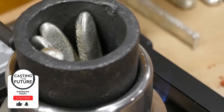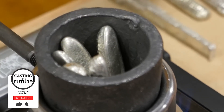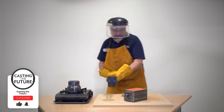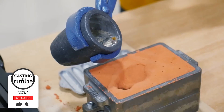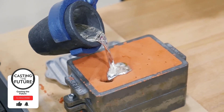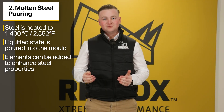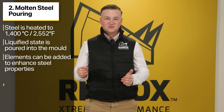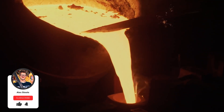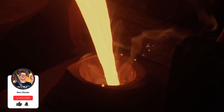The second step is the pouring of the molten steel. After the mould is prepared, steel is heated up to very high temperatures of 1,400 degrees Celsius or 2,552 degrees Fahrenheit, which becomes a liquefied state and is then poured into the mould. Various elements like chromium or molybdenum can be added to the steel to increase its hardness or wear resistance. The molten steel fills the cavity and any minute details etched into the mould.